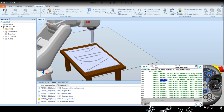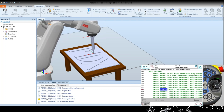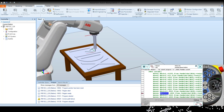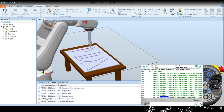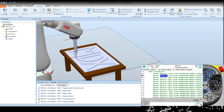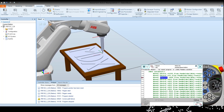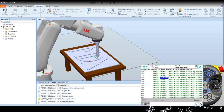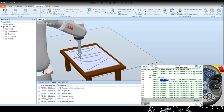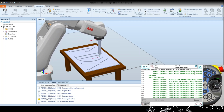One needs to make sure that the movement in the paths has a certain speed, where in a real scenario it will draw our desired figures smoothly. Another point to highlight is that there must be an offset position from the first target of every figure to allow the robot to approach every main path slowly, which must be programmed beforehand too. This will avoid damage to the manipulator, the tool, the surface, and in this case, the piece we are working with, in case we have one.